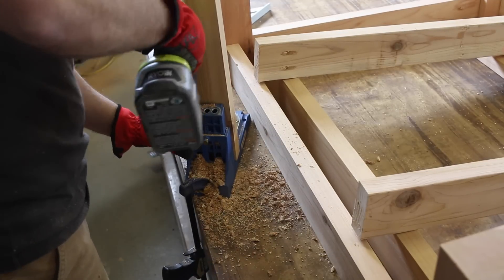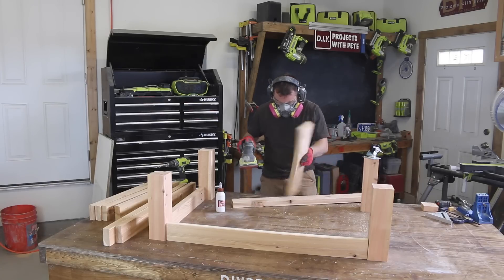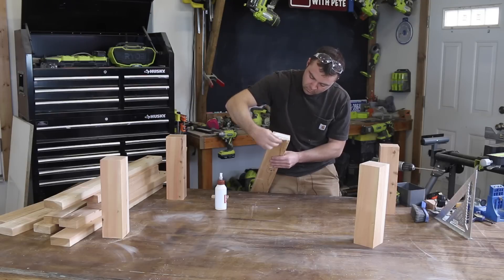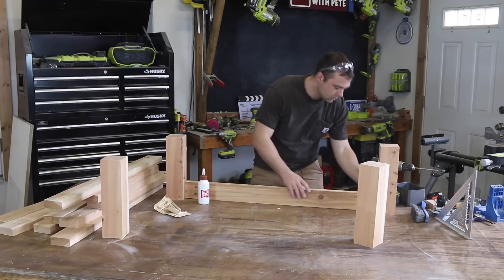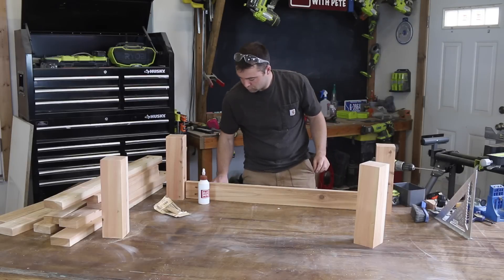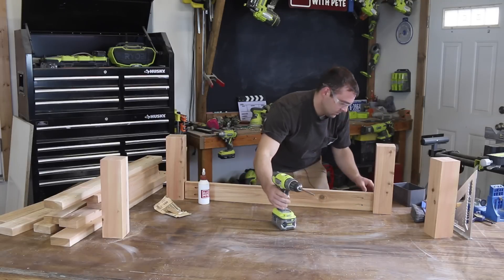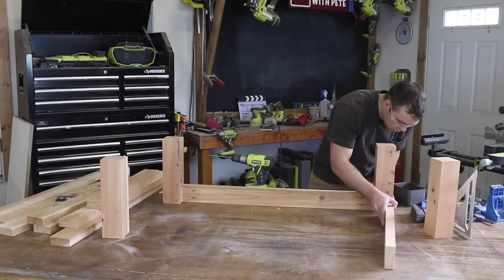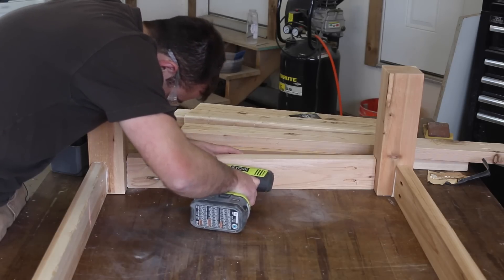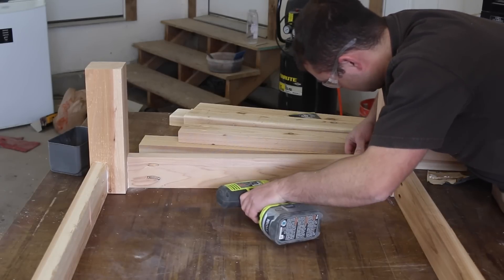If you're into more advanced joinery techniques, go ahead and use them by all means. Before connecting the boards, do a quick sanding to remove any rough edges, then apply wood glue to the end of the boards. Next, align the stretchers to the four by fours. I set the two by fours in from the outside of the legs a quarter of an inch to give the piece a little more dimension. Use two and a half inch pocket screws to tie the boards together, and work around the perimeter until all four stretchers are attached. Take your time to make sure all the boards are square and level.